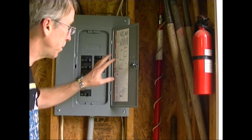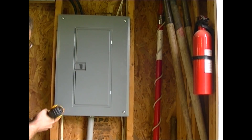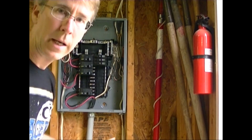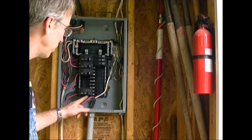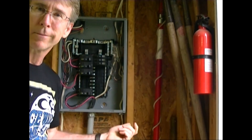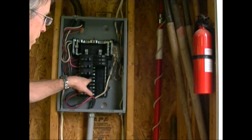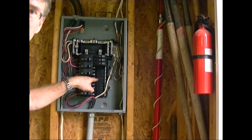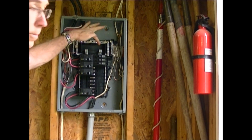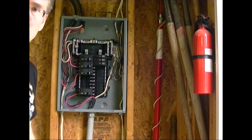The first step will be to remove this face plate from the breaker box so that we can get at the wiring behind it and add the breaker. Once you have the panel off — or even before — you can turn off the main breaker if you'd like, just for safety. I don't care to do that; I like having the lights on while I'm working. Just be aware that these little bus bars in the middle are powered with 120 volts each, and these two bars have 240 between them. Keep your hands off those things and you'll be okay.